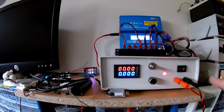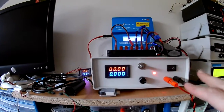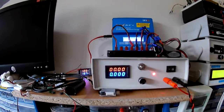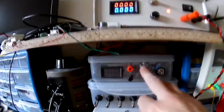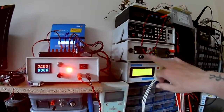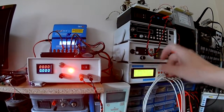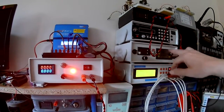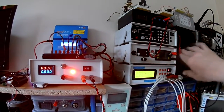So basically this is just my log, and I can have that as my linear supply. That means I've got two that work on the mains and two that work off the batteries, because this one works off the solar batteries. There's a boost converter in here first to take up the power and then this drops it down, which gives me a lot of control.